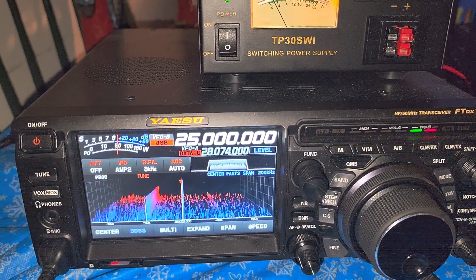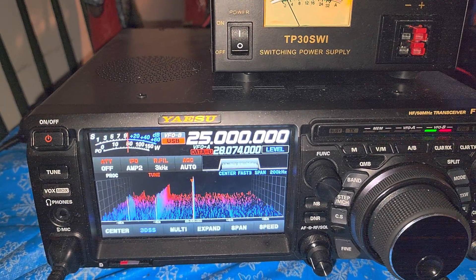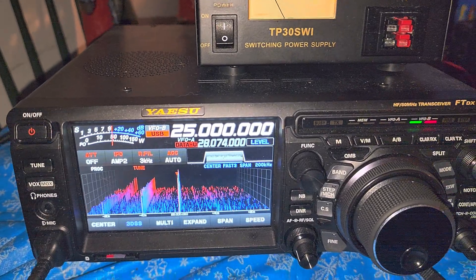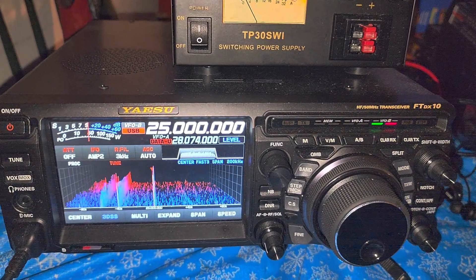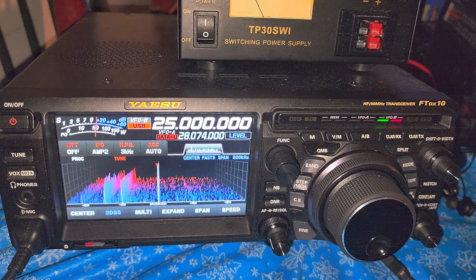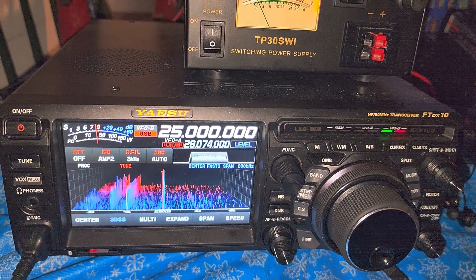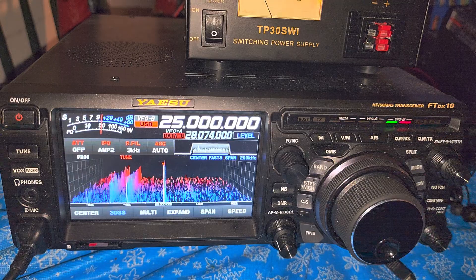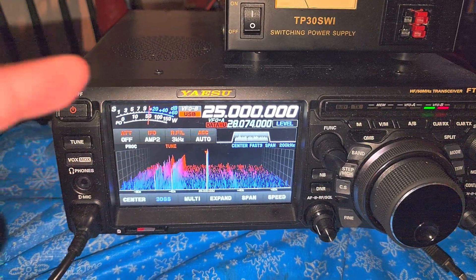So that's the reason for notch filters - they enable you to block just a single tone, so if you have heterodynes or some kind of tone on a broadcast that's annoying, you can remove that tone using the notch filter on the radio. A lot of high-end receivers have a notch, and most high-end transceivers have notch filters as well. Unfortunately, it's not a feature we see on portables - I can't recall a portable that has any of these features.